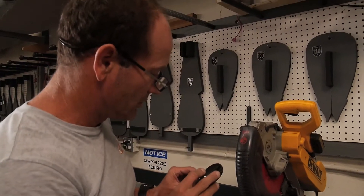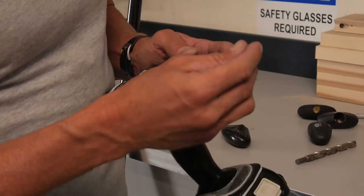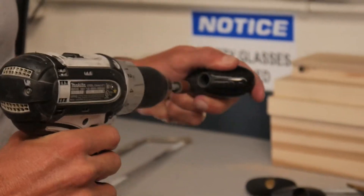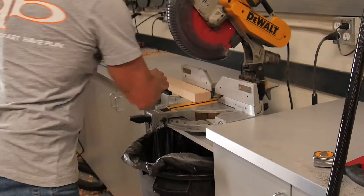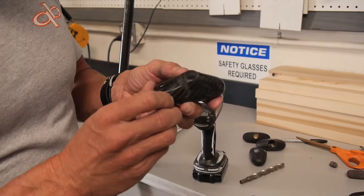The trick now is where to go from here to bond it back on. What we use is a little thumb sander — we buy these little cap ends from McMaster Carr. You might have something similar like a Dremel tool. It's a rubber-ended shank with a pretty coarse abrasive bit on there. You can use a drill or a Dremel tool and just start opening up your handle. You can see the material coming out. Take your time, wiggle it around, and little by little start working away at it until you've got a hole big enough to reposition your shaft. We actually have a special tapered reamer for this, but it can be done by hand.